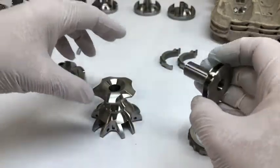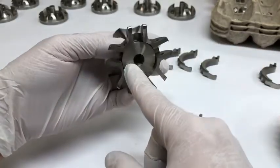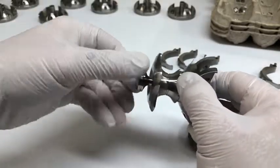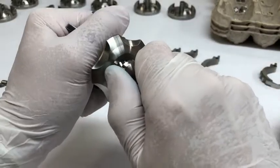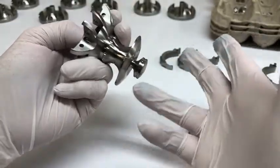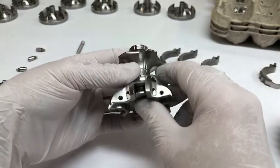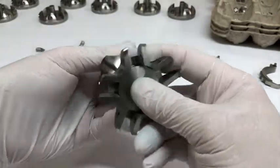Next up, this is the plunger that moves the arms. For the lid, that just has a nice running fit in there. And the knob just threads on there to retain it. I thought long and hard about whether or not I wanted to put any threadlocker or glue on these fittings, and I've decided against it, even though it runs the risk that these may come loose for you. Obviously, it's easy enough to disassemble and put together. I think it's better to preserve the ability for you guys to be able to service your own piece than to lock everything down on the off chance that it might come loose. So that's it — that's a nice snug fit. You can just hold it with your thumb and snug it down.